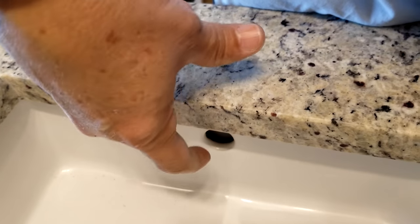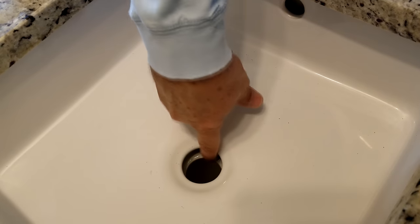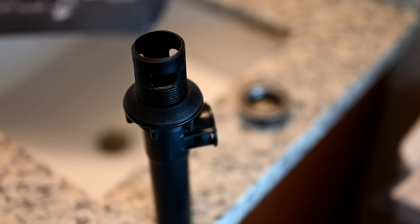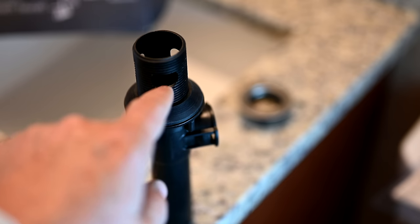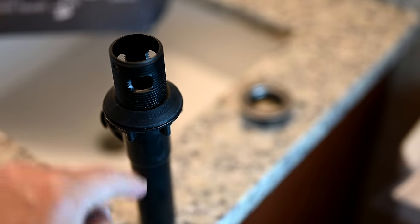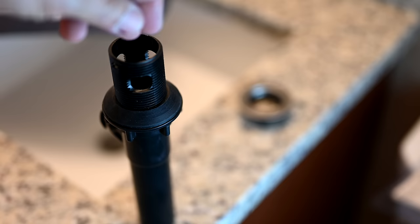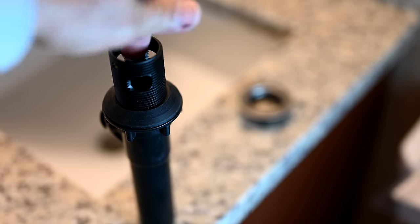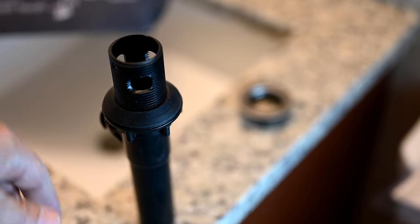Here's your overflow right here. If you left the sink on and running, the water would come in this hole, run down inside the channel, and come out inside the drain. So now you understand how the overflow works. When the water comes into the middle of the drain from that overflow, it goes through these three weeping holes and right down the drain. However, with regular drain operation, water coming in and splashing down the drain from inside the sink can end up shooting out these weeping holes. That's the problem — there's nothing sealing these weeping holes against the middle of the drain opening.